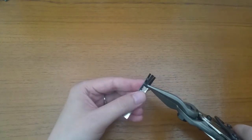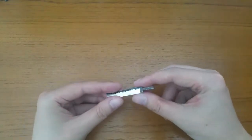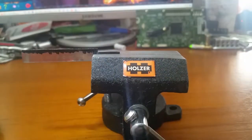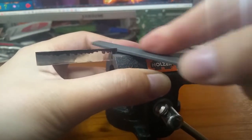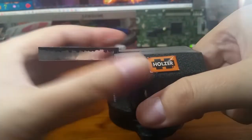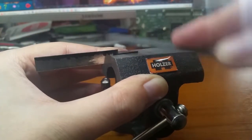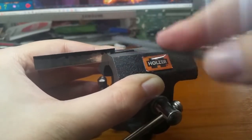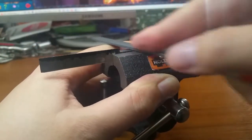Back to the point. He uses a special kind of paint — I don't have that — but the principle is the same. As you can see, the markings are now clearly visible. Thank you Alec for the tip. I'm cutting the material in such a way that not too much material is cut. It's clearly better to have less material cut and then file to the needed size than to have more cut. You can't put back the material if you cut too much. So: cut outside the piece, then file.